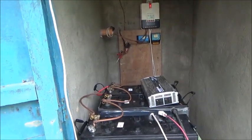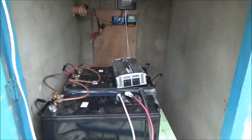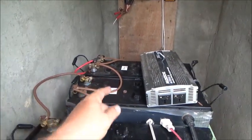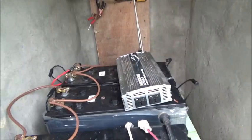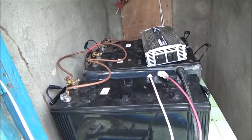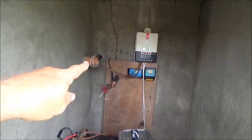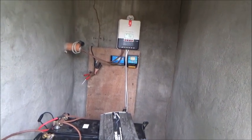Leave it configured to 12 volt. Keep using this old inverter, because if I convert it to 24 volt, that means putting these two batteries in series. Can't use one battery in series, and those two old batteries there, I'm not even going to waste putting those in series and hooking them up. As we move these batteries, I'm going to dismantle one of those old controllers and hook a couple wires to it. That's the only voltmeter I've got.